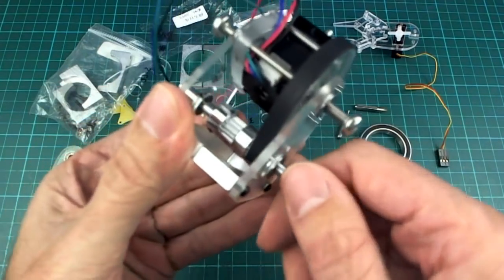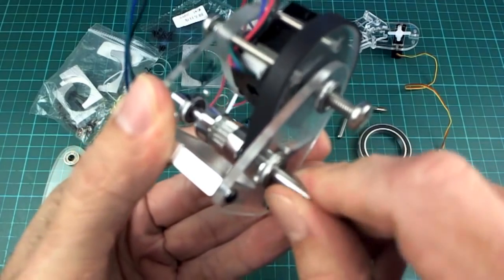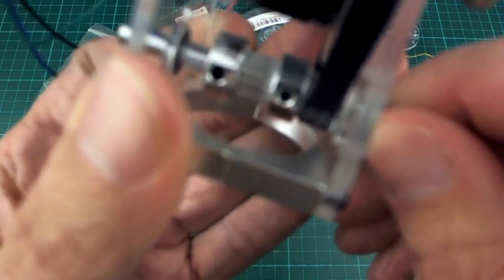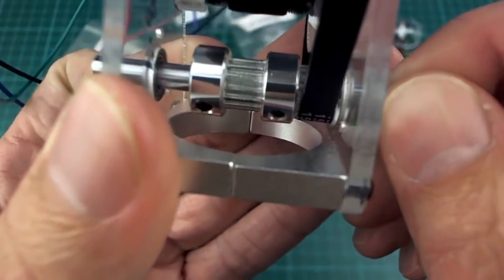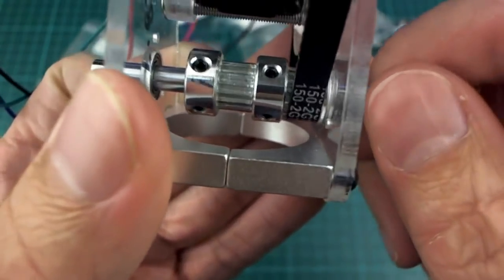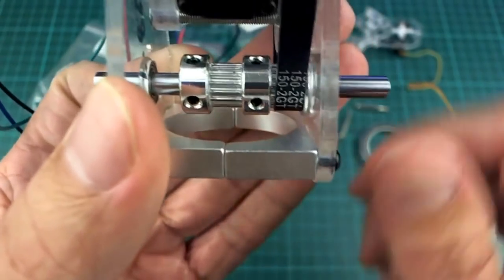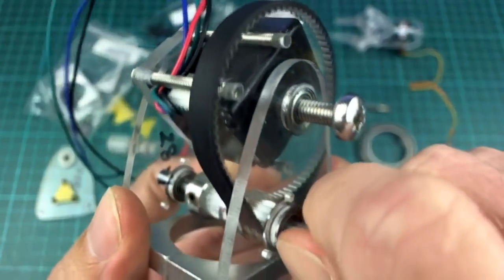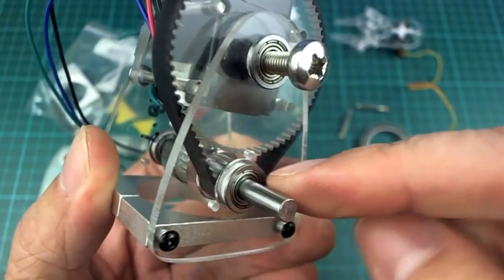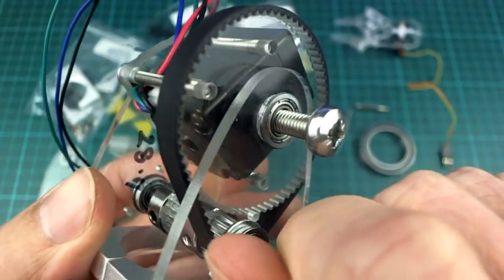And it's also quite easy to move from here. I've just got an extra bit of bearing steel sticking out this side, and see if we can focus on the middle bit there. So those two gear things in there are fixed to the shaft because the belt coming in from the elbow needs to turn this one, and then that's going to obviously turn this. So there's a gear reduction of about 4 1/4. This is 16 teeth and that's 68 teeth, so it's 4.25 increase in torque and reduction in speed.